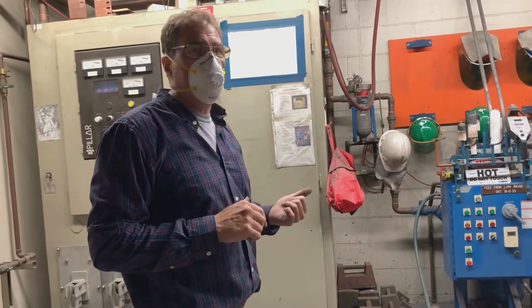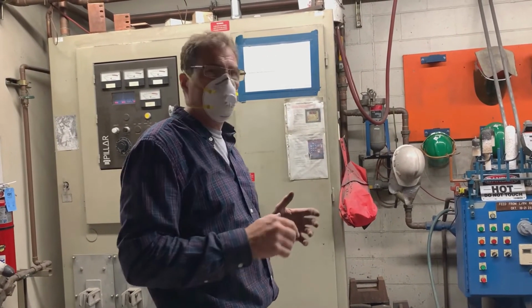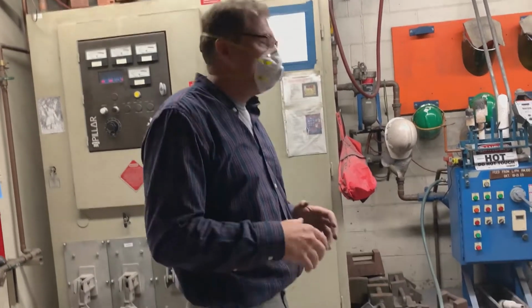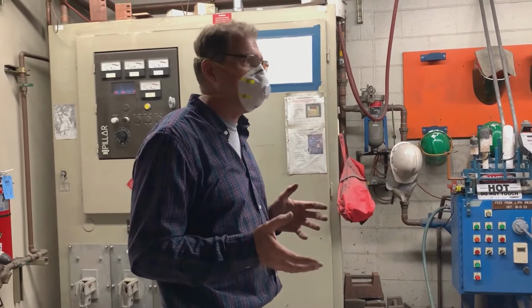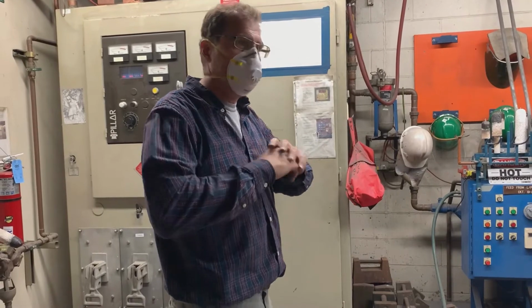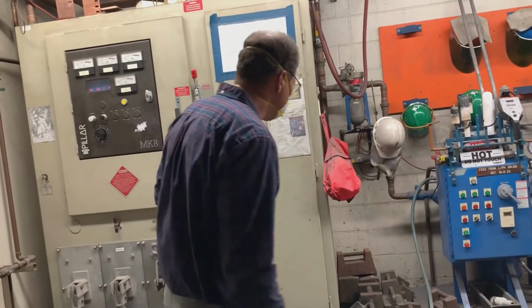It's 50% water and 50% glycol. And it's about, I don't know, $500 to redo the whole system. You got to put deionized water in there. So if we put city water through it, it does some bad stuff. It's like flushing your whole radiator in your car and having to dilute all that crap back out of there and get it all back where it was.